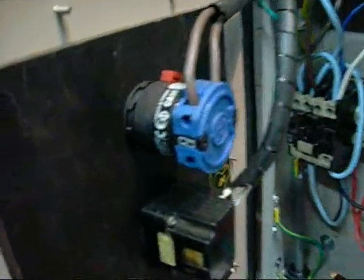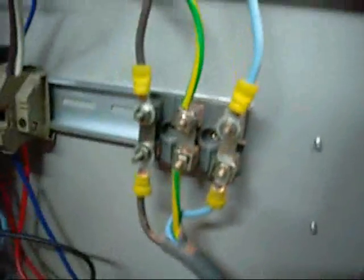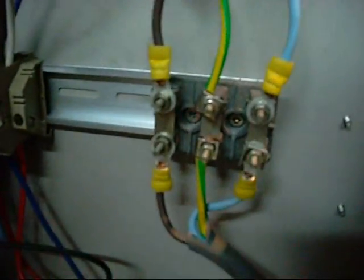This is the switch panel that I built: a master isolating switch, indicator lamp, main contactor, and a few distribution blocks. This one here is your main power in, going out to the wall. The crusher feeder cable screws in here and connects straight to this block.